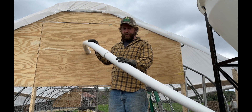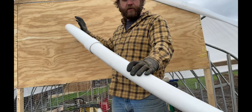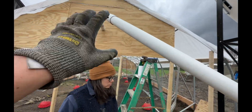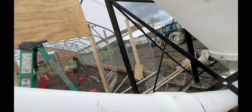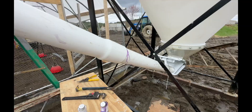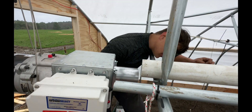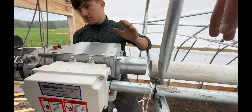Make your lines, take this off, put glue on it, put it back in — this part will be glued, then we'll go on the inside and glue all those joints. Once you get your pipe glued and ready to go, we're going to attach the motor and suspend it from the top of the building with cable and cable clamps, and adjust that until the coupler piece lines up with the PVC.